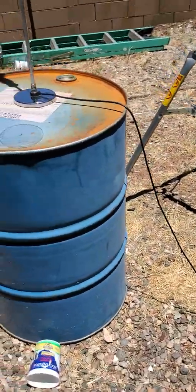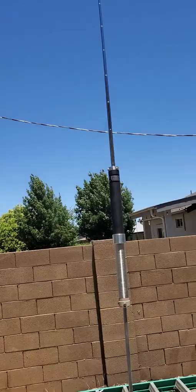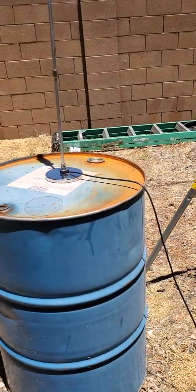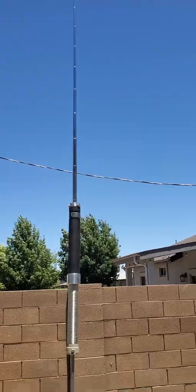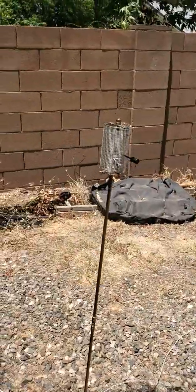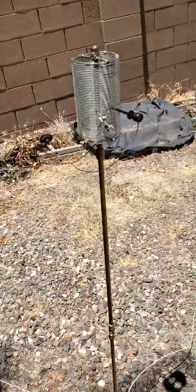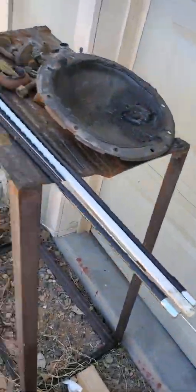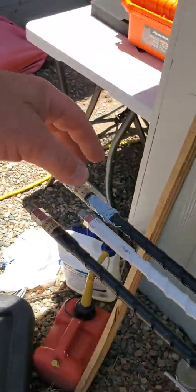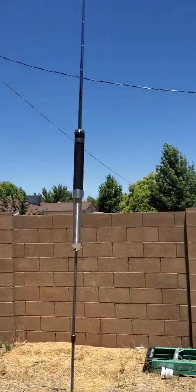It's got to be a whole lot more mass than some radials running. I think it should probably work a little better on 40 than that, mostly because of the design — the top whip's not long enough really. I've got other antennas similar to this; I put a 10-foot piece on one and it works really good on 20. These hamsticks tend to fall apart — if you do mobile with them they won't last, and this wouldn't last mobile either.